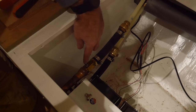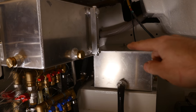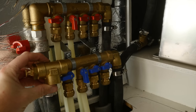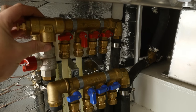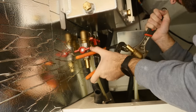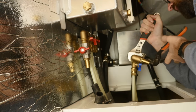I got another bit of advice in the comment section — air might get trapped in my manifolds. So I'm going to do a little swap and put in these fittings with small bleed screws at the end of each manifold that you can open to let air out. On each of the heaters is something that serves the same purpose, opened and closed with a little key, and the same key opens a vent on top of the buffer tank. By adding these air bleed fittings to the manifolds, I'm hoping I'll have a much easier time purging any trapped air.